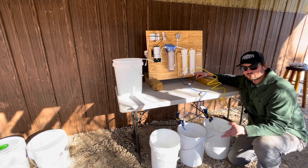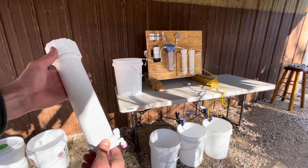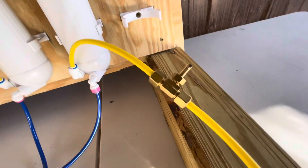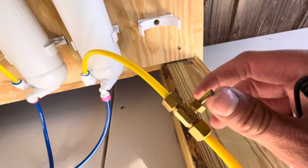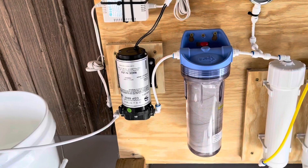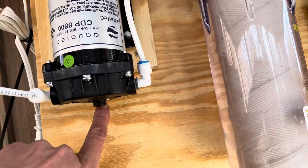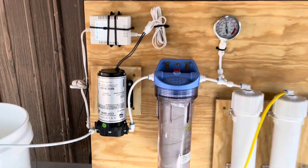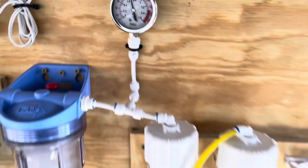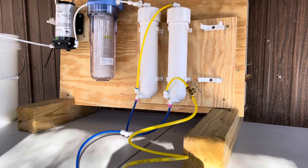You want to be right around 95 to 100 PSI. This is the damaged membrane and housing — I'm not really sure if the housing is cracked or the membrane, but I had water just flowing out of the outlet. I have a needle valve here, and you can use it to increase the pressure if needed. There is also a little allen key spot on the pump, and you can actually turn the pump up or down to help reach your desired pressure coming out of the membranes.